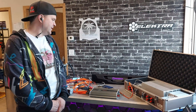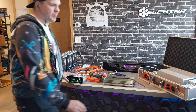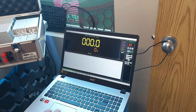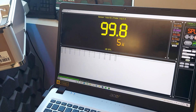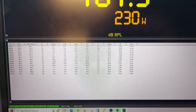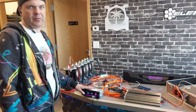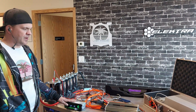Now we're going to run the 2-ohm stereo test on the mid-range side of the 1105 multi-channel amplifier. Result: 230 watts at 2 ohm — it's rated for 120, so that's definitely more than rated power. Another good win, another chance to get your money's worth.